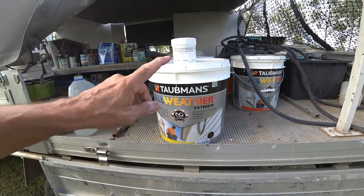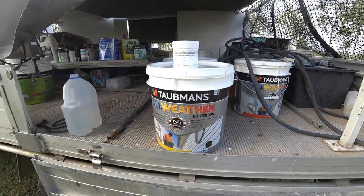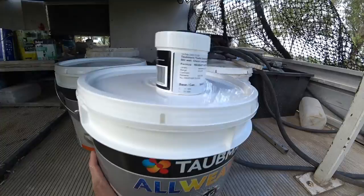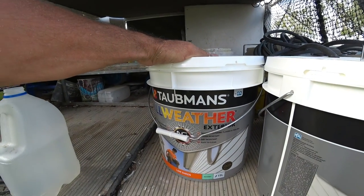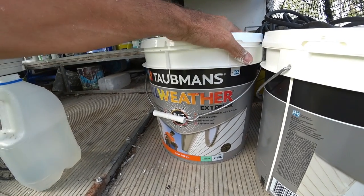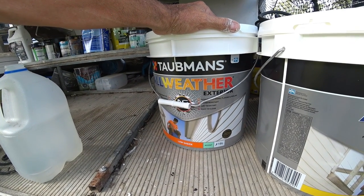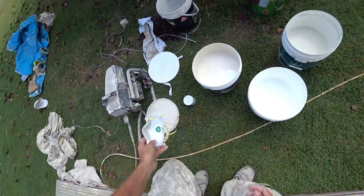Buy an extra drum of paint — you can always take it back because it's not tinted, and you can always use it on your next project or on-sell it. It's white, you can go any color. This one here is a white base, so any color you can do with it. This other one is the accent color, which is an accent base — a darker green in a low-sheen. That'll be for the rafters. It's also the gutter color, but the gutter colors are gloss and this is low-sheen. Low-sheen sticks better, covers better. Then use gloss if you're going to put two coats on; if you're only doing one coat, use this one.